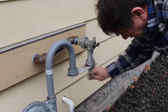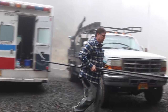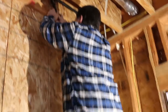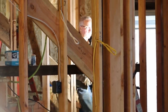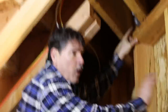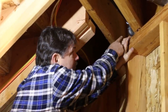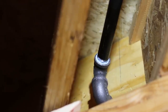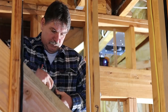This is for our gas tank. We're going to go around a couple of times. Another 90. The wall in the building is at a funny angle of no known degree. There's a fitting that makes that angle, but we've made a swing joint where an elbow and an elbow are stuck together — that'll swing to any angle you want. It goes back to digging a ditch with a funny angle. You can use a swing joint to get any angle you want.